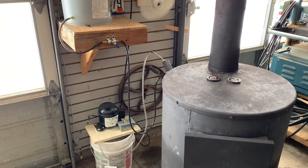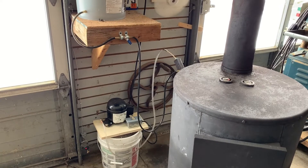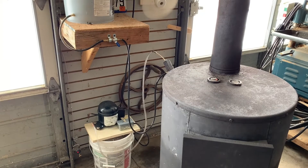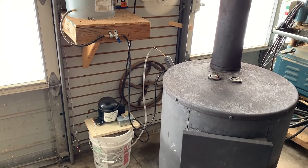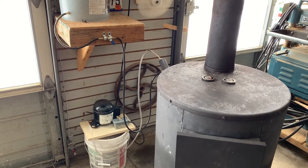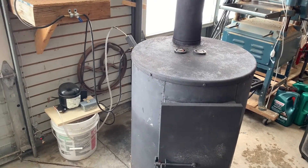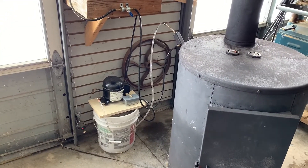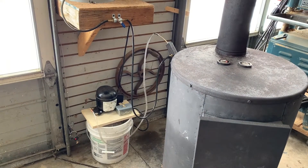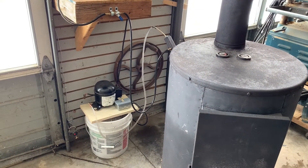I'm making this video primarily because I looked on the internet to try to get some guidance when I put this together. I tried a lot of different fans like hair dryer style fans and things like that. None of that worked — they were really loud and obnoxious and moved so much air volume that it would start to leak out of the wood stove box. But this refrigerator compressor does the trick: small amount of air, but very high velocity, high pressure going through that small copper tube — tremendous amount of combustion, tremendous amount of heat. It works great.